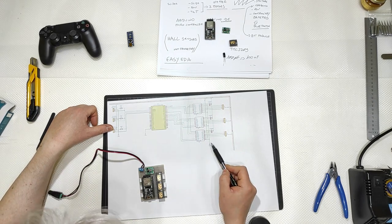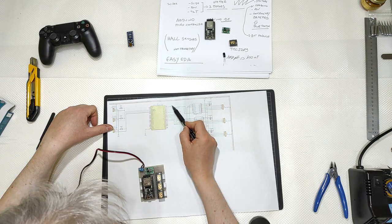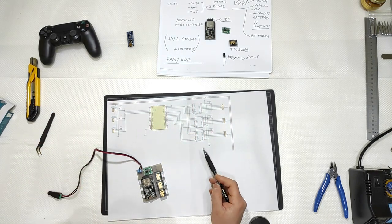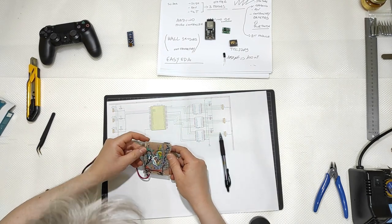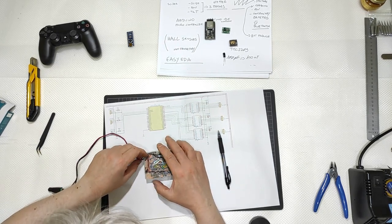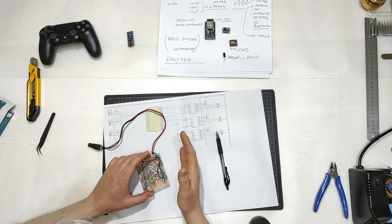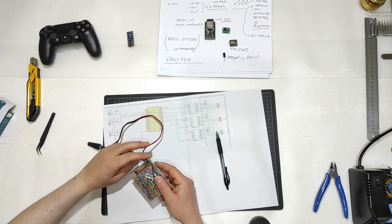And where you have the ground like that, this point is connected to this point because you have ground. And it is also connected to this point. That's the difficulty of the wiring there, especially because you need to work upside down, so the pins are inverted when you work from the downside. Left is right and vice versa.